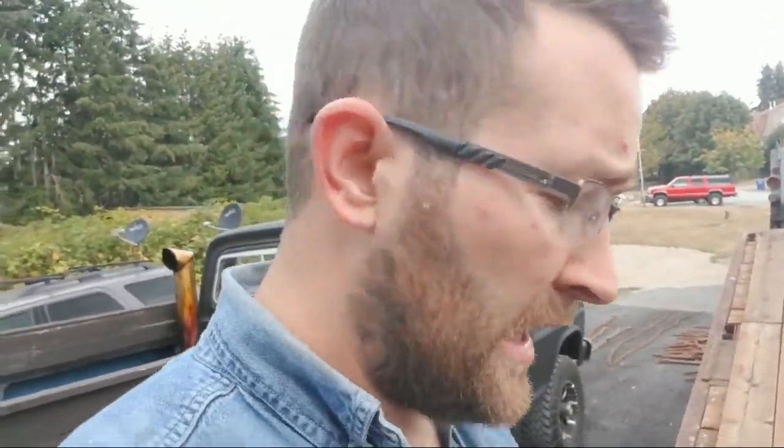I would recommend to anyone and everyone a welding mask that is auto darkening. Okay, don't cheap out on a welding hood, because when you're going like this all day, doing the head banging rocker thing, you're going to give your neck a serious pain, and you're not going to enjoy the welding process as much. And it's a lot easier to start stick welding with an electric hood, because you know where the rod is when you're striking it. If you flip down, you can't see anything, you're trying to find where it's going to stick. Don't do it. If you have to be cheap on it, get a cheap one.